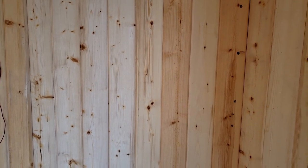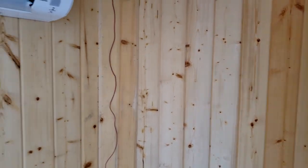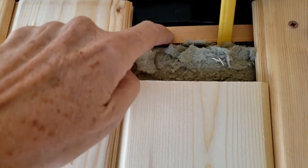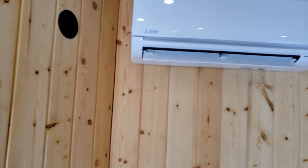This is where I first started at the front, and I made so many holes trying to get the boards attached to the metal studs that it looked awful, so I ripped it all off. What I did instead was start putting furring strips across the metal studs — you can see one up here. I needed this gap for running the 110 wiring, because all the wiring is behind the walls. That way I could just attach the walls to the furring strips that were attached to the metal studs. That gave a much cleaner look and worked out pretty well.